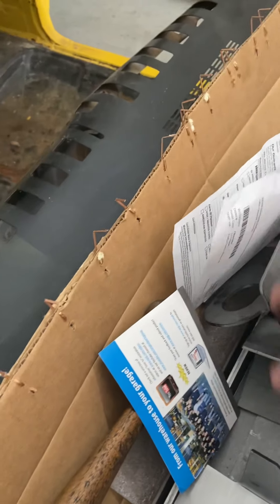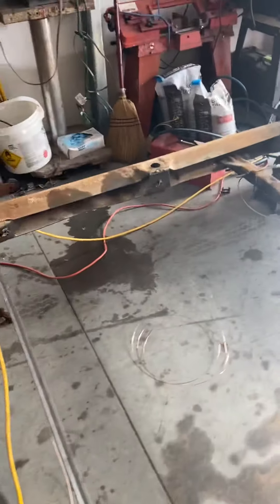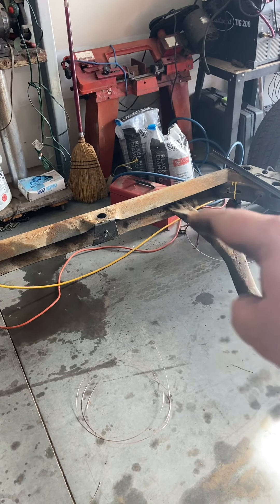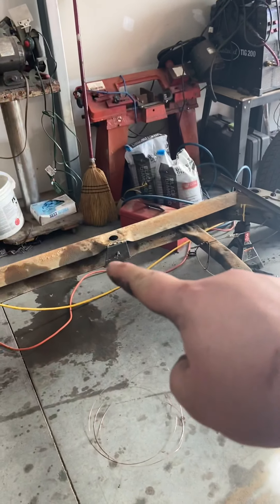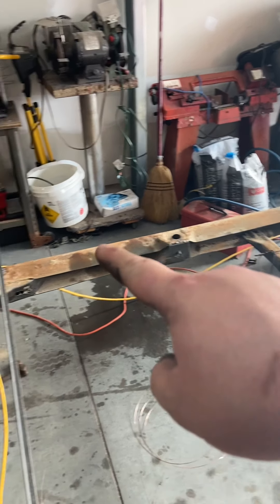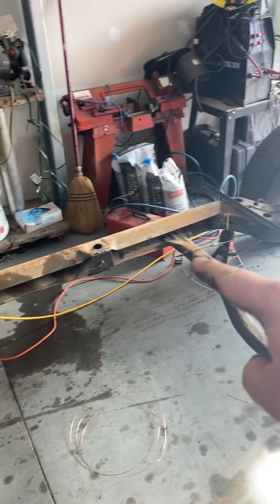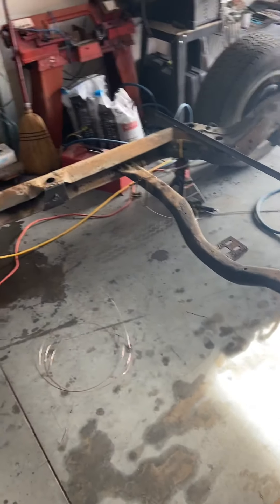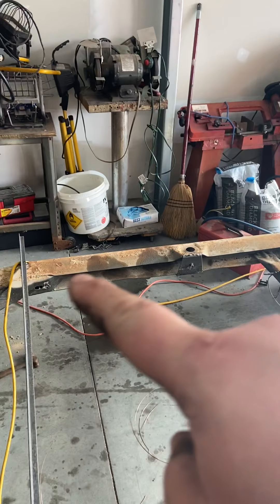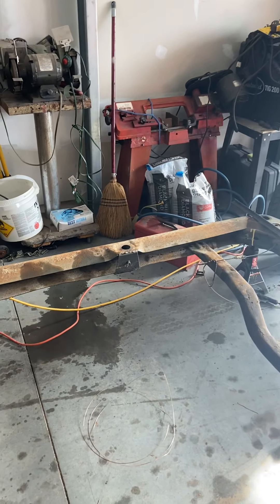It's got a bunch of little pieces that you go in and weld in — you're boxing the frame in to stiffen it up, right along in this gap here. What we'll end up doing is taking this cross member out here, and then this piece we'll end up cutting out. I'm going to sandblast this entire area, everything on the insides on this side too.